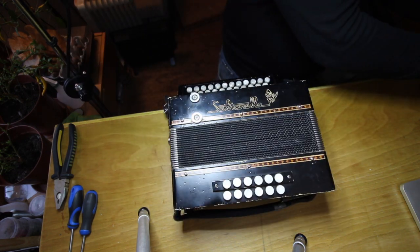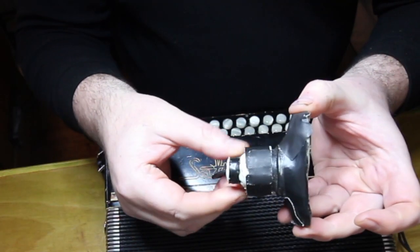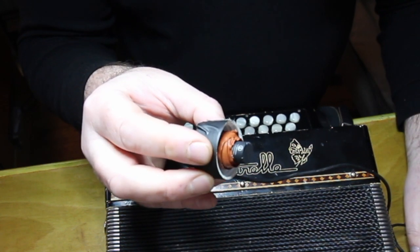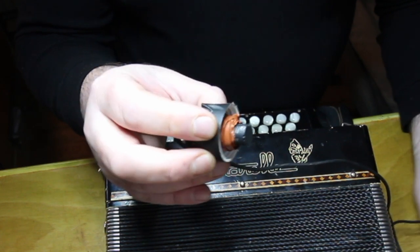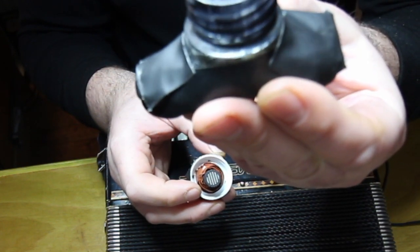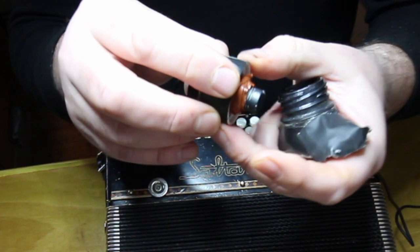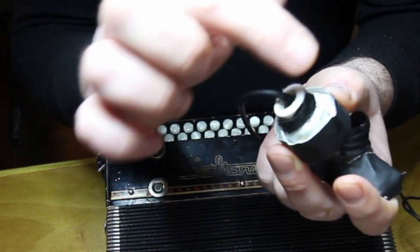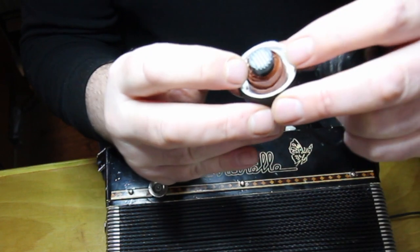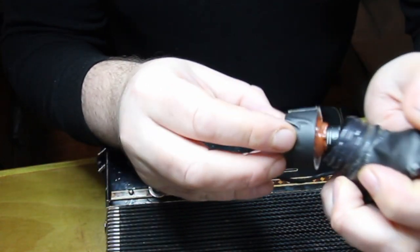And so here is what I've done for the microphones. For the left hand one, this is the little device I've made. Inside there is just a fairly standard microphone capsule, an Audio Technica condenser mic. This part, I don't know if you can recognise it from looking at it, is the top of a sports cap water bottle, this screw bit, and here's its counterpart here. I've made some holes in the end here to allow the bass waves to go through, and then this microphone has been put through, and then I've wrapped it with some electrical insulation tape until it fits in the gap.